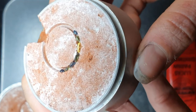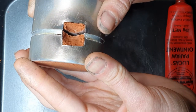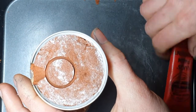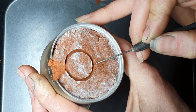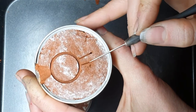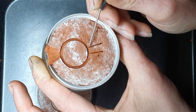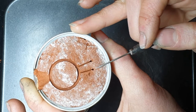Now it's time to close the mould and open it and see if these stones move. Wonderful, everything's in position. Let's do the air vent. I'm just going to do two on either side. You may be wondering why I'm doing two instead of just one. It's because I think that the center green stone is going to sit about here and I don't want to do one air hole that the green stone is going to block. So I'm going to do two air vents.